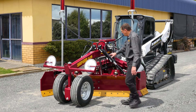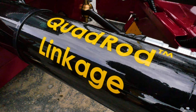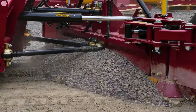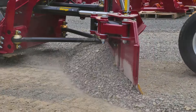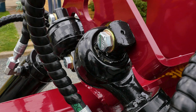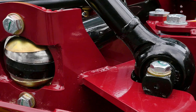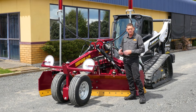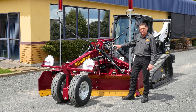The blade is supported by three quad rod linkages so the blade remains vertical throughout its travel. These are sealed, shielded and lifetime lubricated, so you never have to grease any of the linkages. The cylinders also have our own design sphericals on the end which are sealed and shielded, with steel shields to keep the grit out. We're really focused on low maintenance and maximum uptime.